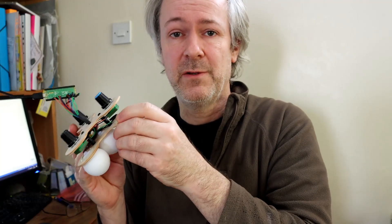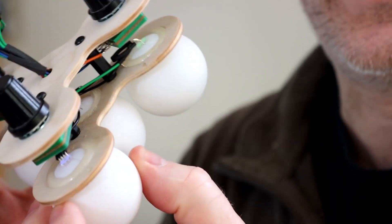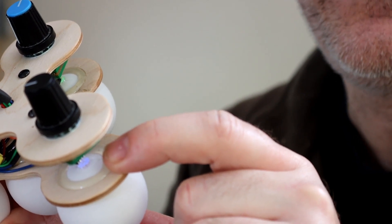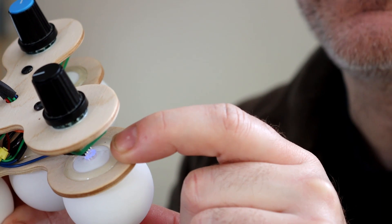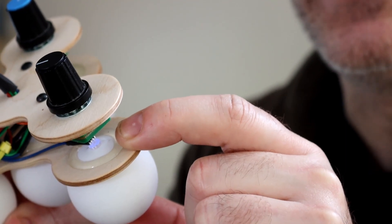You can see I've reduced it a bit and now it's flashing on and off — so that's a bit random. And then the blue does a similar thing: it's brighter, brighter, brighter, and just as it approaches the top it goes off — there it is flickering on and off. And then let's reduce it down to zero again. So that's the first thing that's a bit weird. The second thing is the LEDs are not actually 100% off — there's still a little pulse getting to them, which is a bit weird. So there's two little problems there which I need to have a look at.